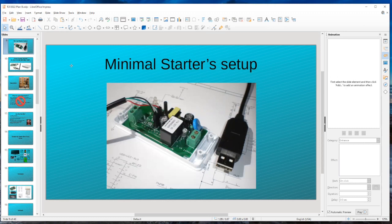Okay, so you can technically send an HTTP request via REST to it to turn on or turn off, or to give you the information. You can query it. It just happens to have MQTT also. If you program it for MQTT, it will publish that information automatically. So you can start off real simple: buy one of these. You can buy a dozen of them if you want, and just have simple scripts.